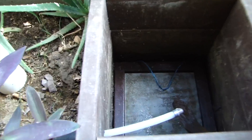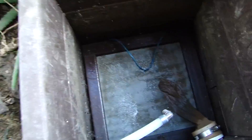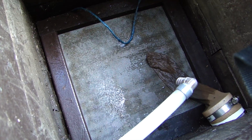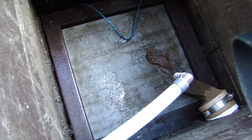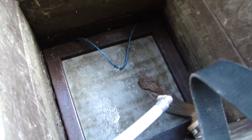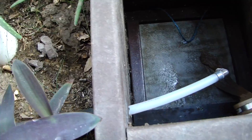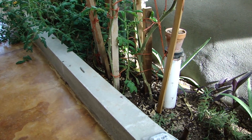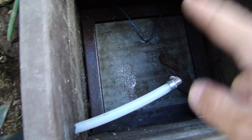So I put the filter fabric down, but it was an experiment. I had the filter fabric underneath the reception cell here. What that was doing though — that filter fabric got all clogged up and mucked up and it caused the reception cell to back up, which was bad. It was creating a lot of smell; the graywater smelled because of all that muck. So I want to state that there is filter fabric underneath the whole length of the planter, underneath the dirt and sand at the bottom of the sand, separating it from the three-quarter inch rock — but not in the reception cell. I just cut the filter fabric out of the reception cell, put this pantyhose filter on, and problem solved.